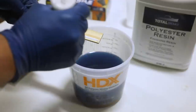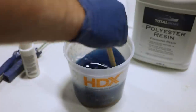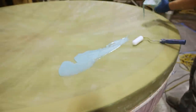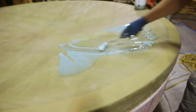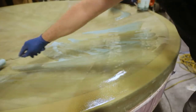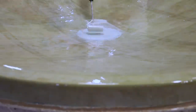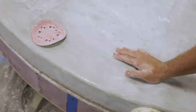We decided to tint the resin white because the goal was to have the bowl be translucent rather than transparent. If I did this again, I'd probably add a bit of white throughout the process. A bit of extra fabric was added to the center of the bowl where a fitting would be attached. After a final sand with 220 and trimming the lip, the bowl was complete.